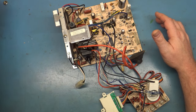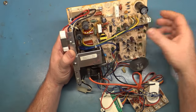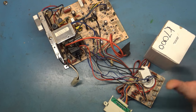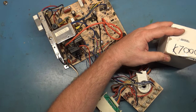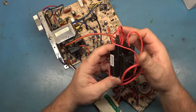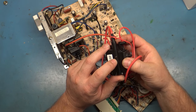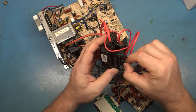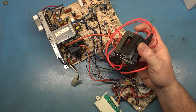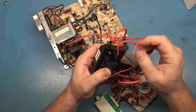We're going to have to figure out why we have an all blue screen with the retrace lines. The first thing I want to take a look at is the flyback that was originally in here before they put the factory one back in — he sent that with everything. Let's take a look at it. It looks like someone tried to cover up a hole in it. That overly blue image with the retrace lines is almost absolutely a G2 voltage issue — our G2 voltage is sky high.